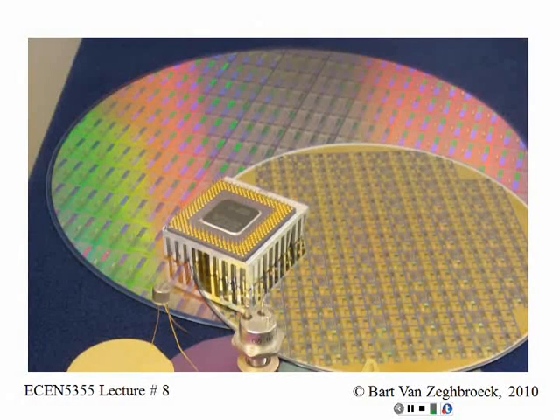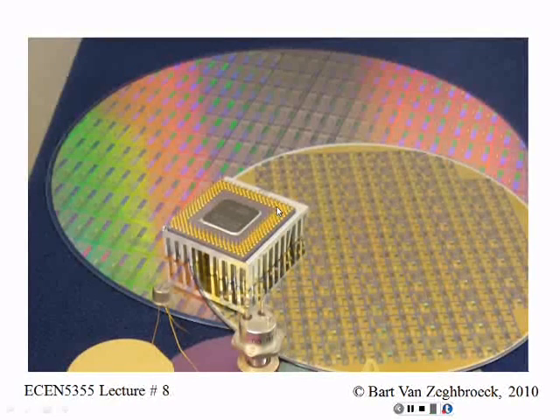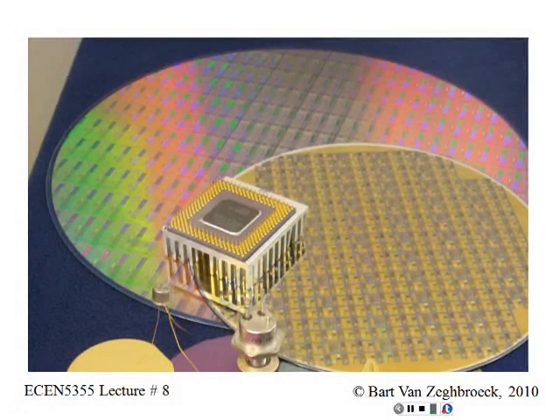Packaging isn't just a matter of connecting the electrical leads. Even there, you have to be careful that you have low-resistance contact, of course. But typically you have high-speed signals — at a gigahertz rate, we feed data in and out of that chip. And so it needs to be a high-quality, high-speed connection also, which means typically that you alternate signal and ground lines.